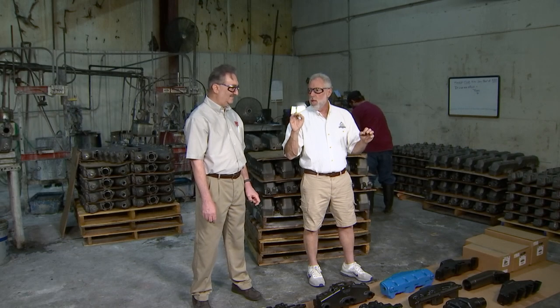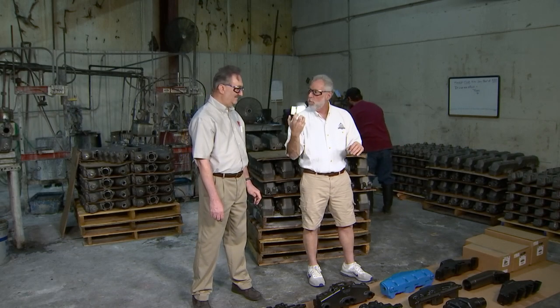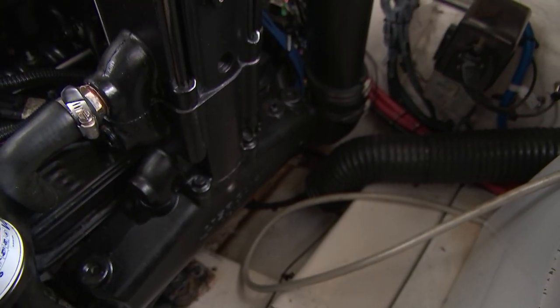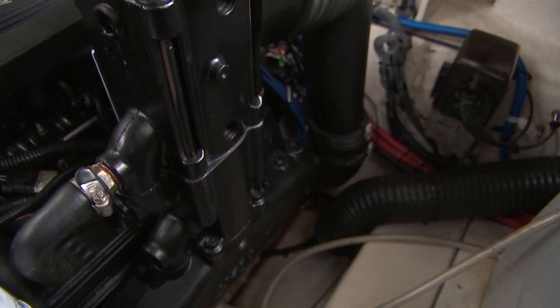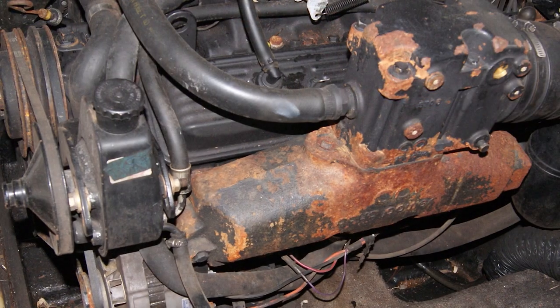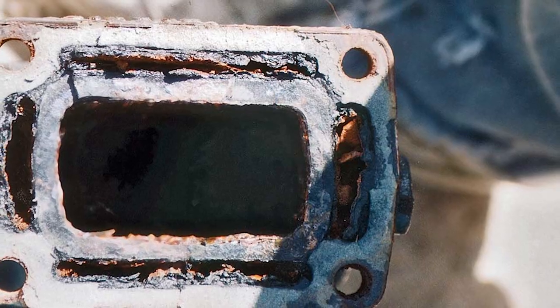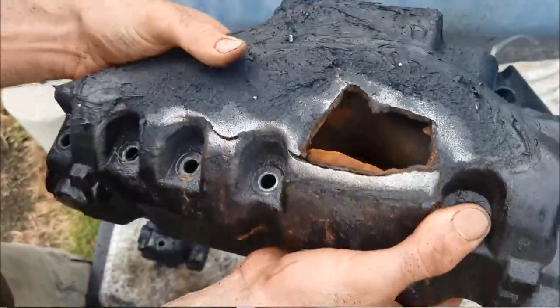Now, what's the difference between Bar Marine exhaust and others out there? I really want to get into how marine exhaust works. Literally, you're taking seawater up into the engine — it's going through these cast iron parts and it's transferring the heat, keeping the engine cool. It's going to corrode in salt water — trust me — you're going to replace these parts.